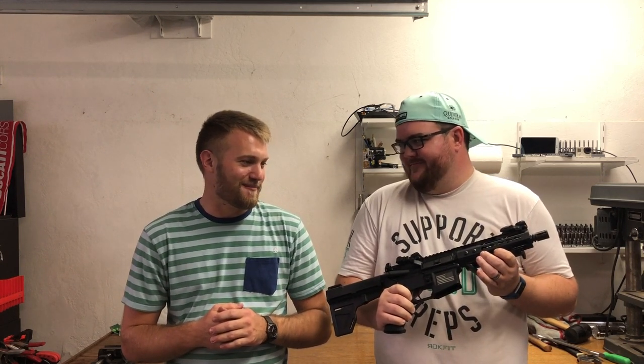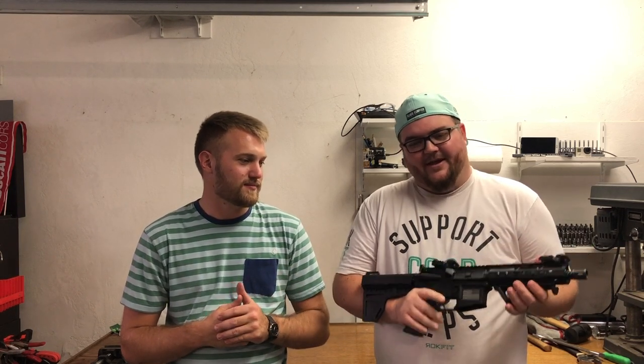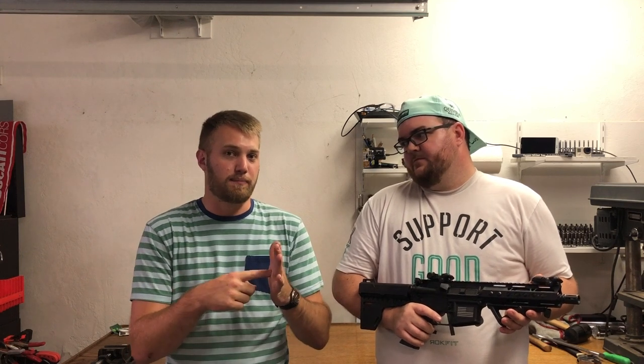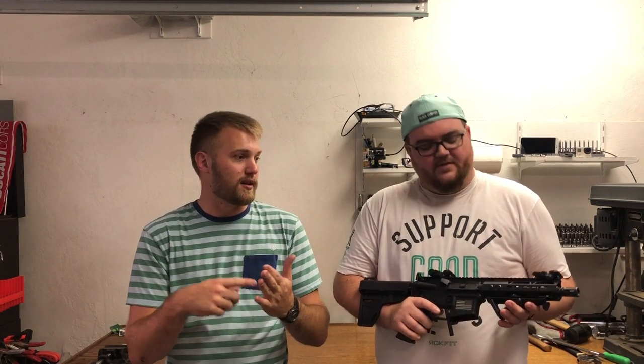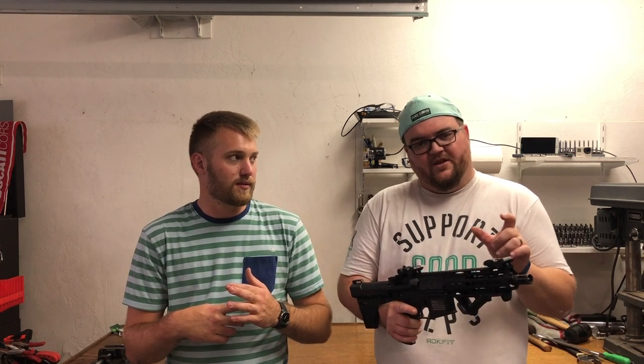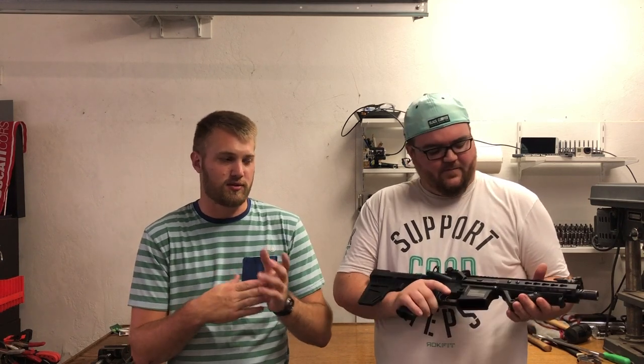So, what did you think of your first AR-15 build? It was a lot of fun. Had a couple speed bumps along the way. Yeah. But there's one thing that, to be honest, we didn't show on camera at all, and that was we didn't put the gas tube in all the way. We put it a little bit too short into the gas block, so the tube itself was going too far, which didn't allow the bolt to recede completely. So we had a little bit of trouble.